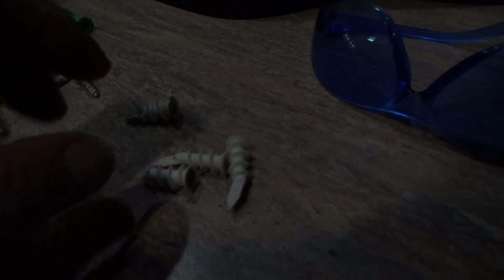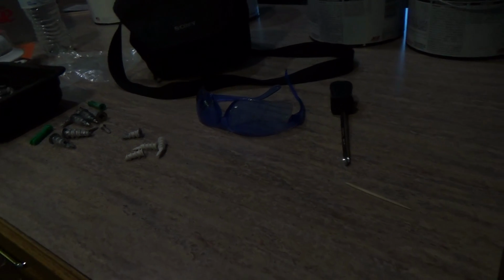And see, when I took these handrails down, everything looked pretty good except the top hole on the left-hand side, this one right here, was just spinning. So I know I'm going to have to put a little plastic anchor there. And as you will recall, I've got at least three little plastic anchors here that I can use in a pinch. I might have to use this little metal one, but I'll try the small ones first. And if that doesn't work and something starts spinning, I can always go slightly bigger. I can't put a bigger one in and then go smaller, because if this one starts spinning for some reason, I can't just put one of these in, because the threads won't stay tight to the drywall. Do you see what I mean? All right, enough of that. Back to work I go.